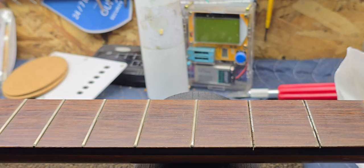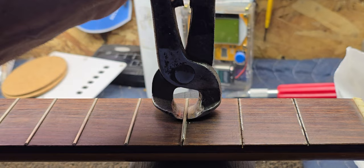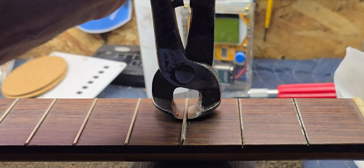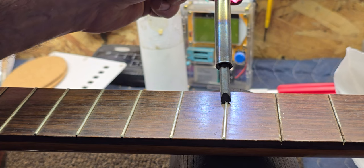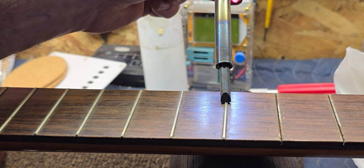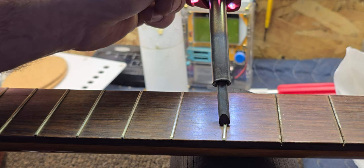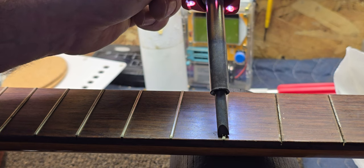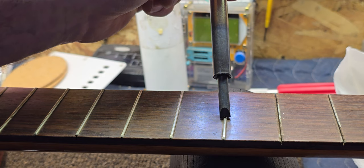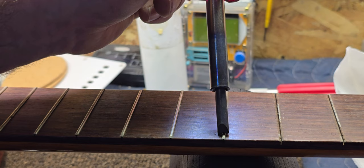Once I get that end started, I can just walk right across it and let the pliers do their work. These were glued in previously too — I can see residual glue, that white stuff along each side of the fret slot. When the fretboard cupped, it pushed the ends of the fret wire up and they just went with it — it even popped some of them loose. It's just the nature of them. Some of them do it. This obviously got dry probably more than once in its life, and that has a lot to do with it.